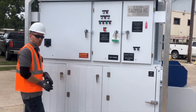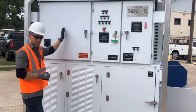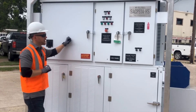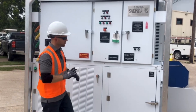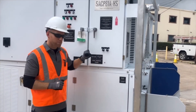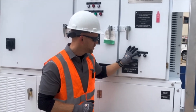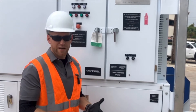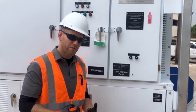Check to make sure that the voltage you're giving to the unit matches the phase monitor setting, and check your voltage phase to phase and phase to ground. The next step in the startup procedure is to generate airflow, so I'm going to turn my exterior airflow switch from off to on. This unit is equipped with a VFD and I'm currently running the blower in VFD mode.